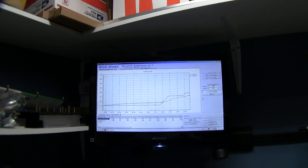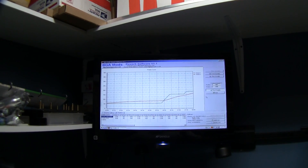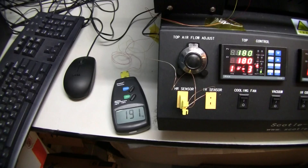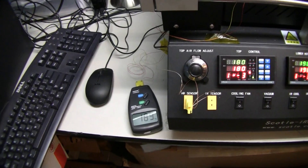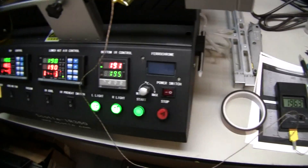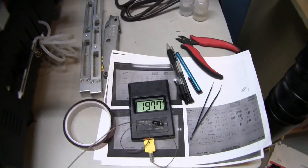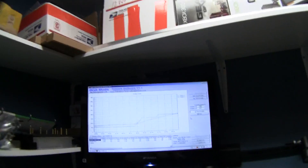Our component is now up to 155 and our boards are holding their temperature. This is what you want to see — you want your board to try to maintain around 180-190, something under 200. We don't want our boards getting into a dangerous temperature. This side is getting pretty hot so we'll definitely see some hotter temperatures as that bottom hot air climbs higher. If we see this climb over 200, we may actually need to kick our bottom IR heat down a bit to compensate. We're now climbing into our fourth phase.